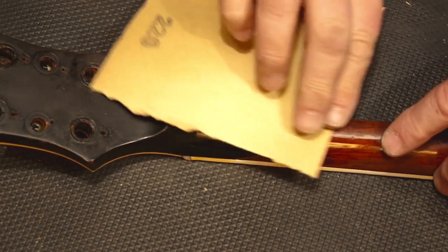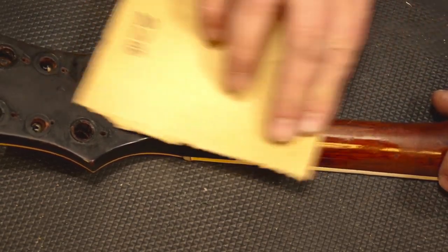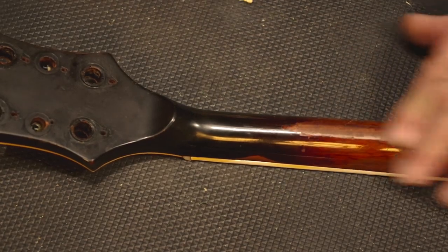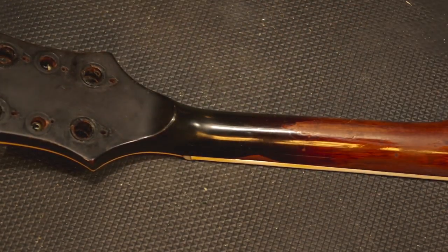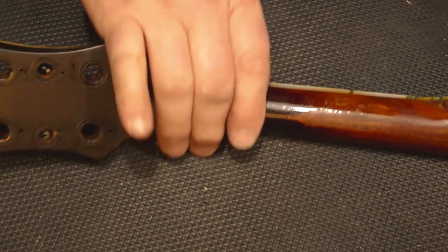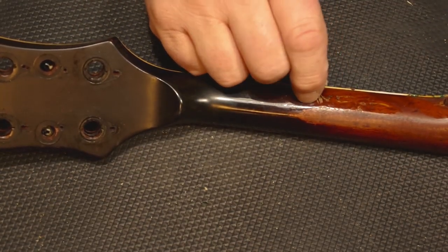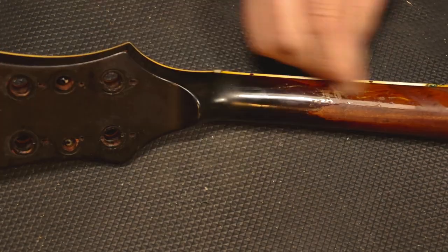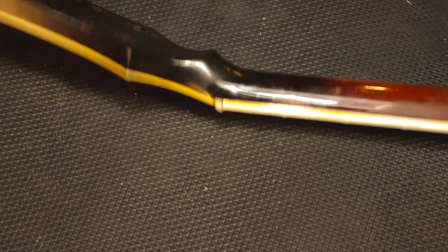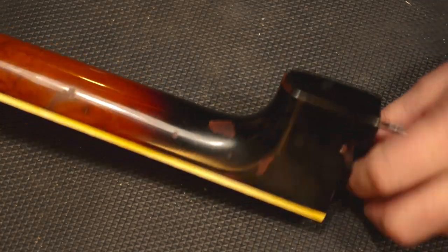I can see that the color in this finish is mostly from the lacquer itself, not from a wood stain — the wood looks almost natural colored underneath the dirt. Just a little cleaning of the wood — it doesn't really change color other than black dirt coming off. My fingernail alone is strong enough to gouge this finish off; it just flakes off when you touch it. The finish is trashed and has come off in big chunks.